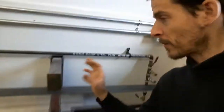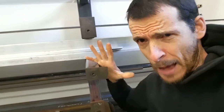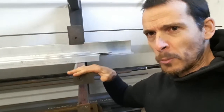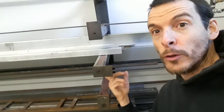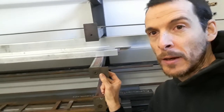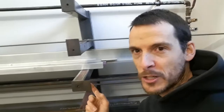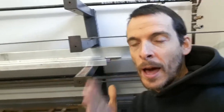The other feature on these things you can't see until we get down here is these front tabs turn, so you get full usable height in here. All this is, there's a piece of angle iron inside, a hole was drilled to plug weld the angle, and it's an inch in, and then it's just got a compression spring. I just had some random long springs and I cut pieces with a zip cut.